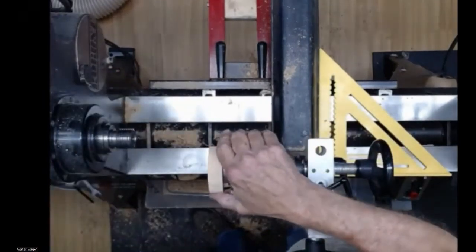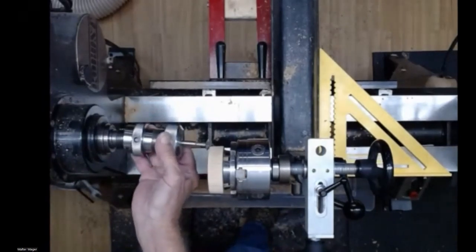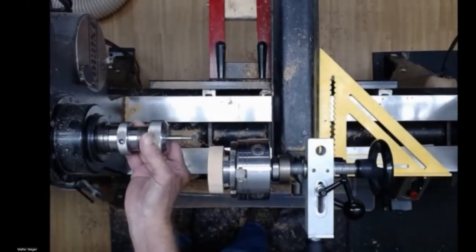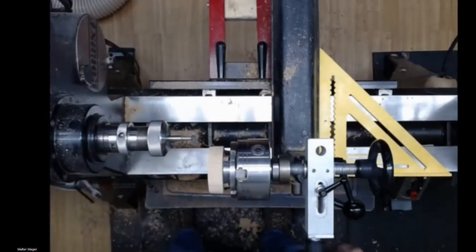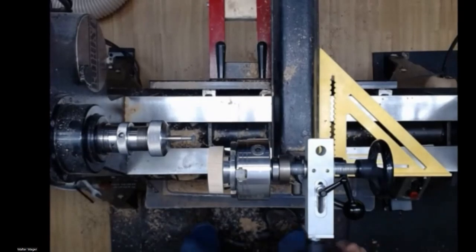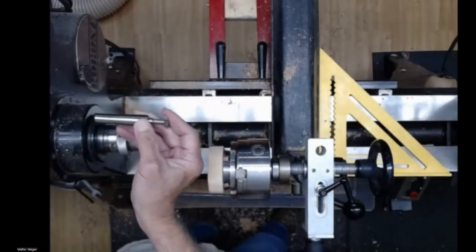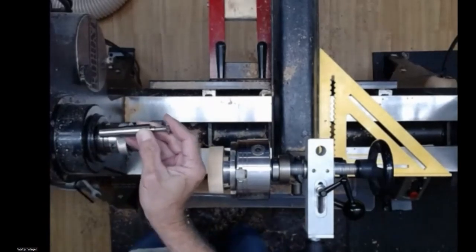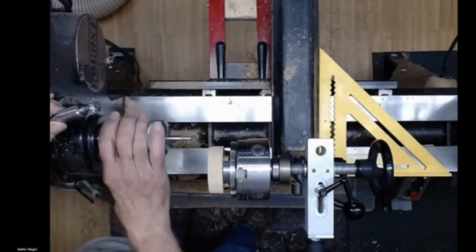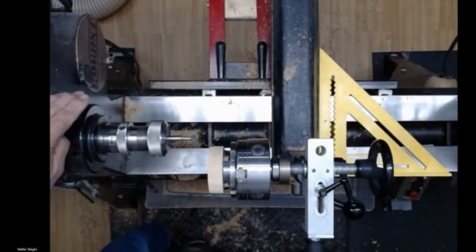And the cutter that I'm using is mounted in a collet. It's a 60 degree thread cutter. And there are other kinds of cutters. This is another cutter. It's in a collet that you would use in a Morse taper spindle, and you would have a drawbar on it to tighten it up. But we're not using this one. This one has a collet that you can tighten down without the drawbar. Either one will work though. Any questions about that so far?